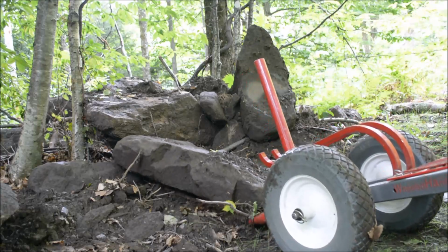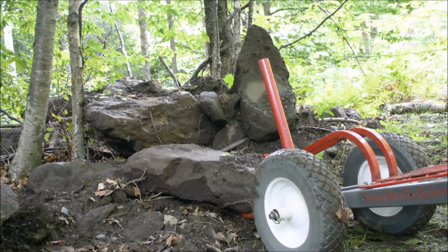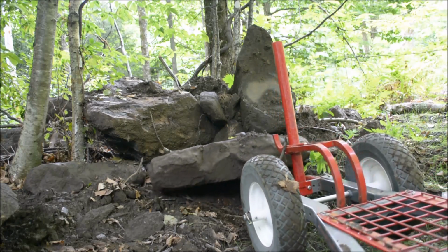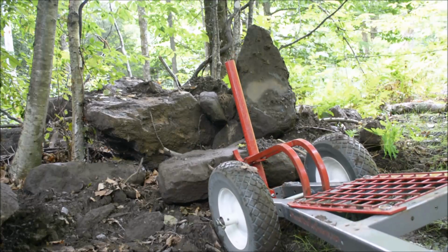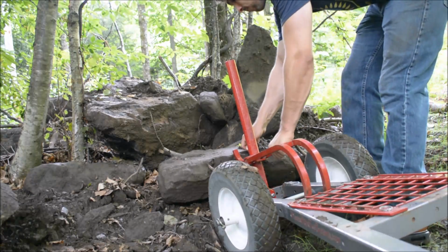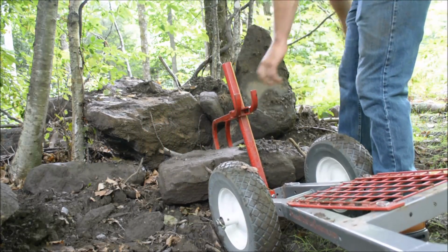Here I'll do the same thing with a bigger rock. You'd have a really hard time moving this rock by yourself otherwise. But look how much leverage I've got. I just move it into a position in which I can stick the pry bars somewhat deeply under it. And then I'm going to swing the clamp arm around from transport position, just so the teeth can dig into the end of the rock.